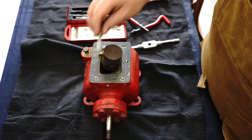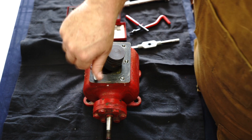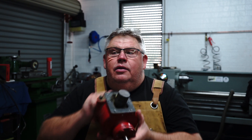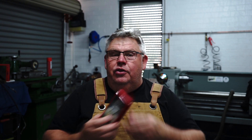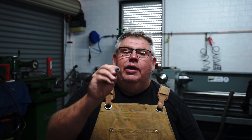We can check to make sure they're in there correctly. The cap head bolt goes in no problems at all and bottoms out all the way. Beautiful — this one's finished. Thanks for joining in today ladies and gentlemen. I've got all the helicoils put in. The kit I use is this one here — I'm not sponsored, I bought this about 25 years ago. And we got that broken bolt out — it came out in one piece, which I was really happy about.